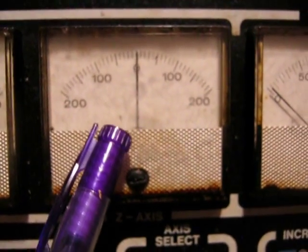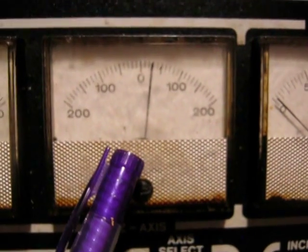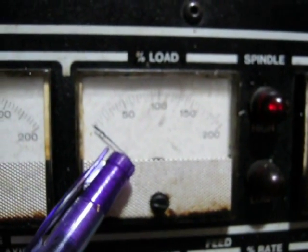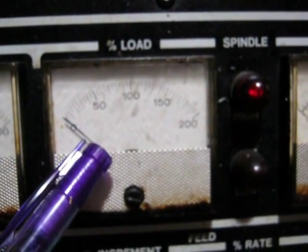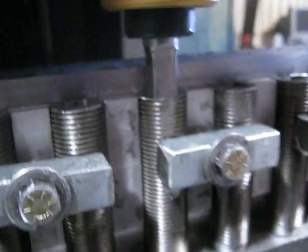I'm a stickler for the meter. I'm running a 30% Z-axis motor load on this tool. I want this spindle load to be absolutely at zero, because if I start seeing a spindle load, that means the bearings are going to pop in the rotary fixture.